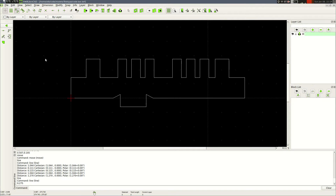I looked up the name of these parts in the teletype documentation — they call this a 'code blade.' The part I was calling the stop bar they actually call the 'code stop blade' or 'stop code blade.' The dimensions of the code stop blade are the same as the code blades in the bottom part, and then it's just squared off on top — a simple enough modification. We'll do that modification in CAD and have some of those fabricated as well.